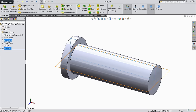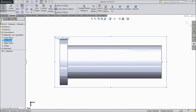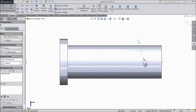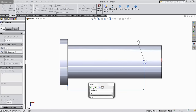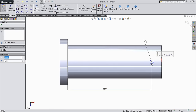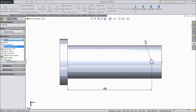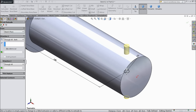Okay. Now choose top plane, sketch, and here we want to make a hole for pin. Draw one circle and keep the diameter 6 mm, and the distance from this internal head 130 centimeters. Okay, and make one relation, the hole center and the origin point should be horizontal. Okay, now let's extrude cut, choose through all. See, it will cut both direction. Okay,